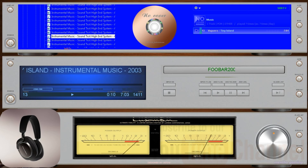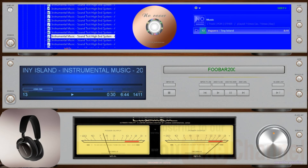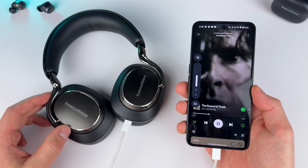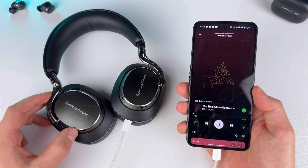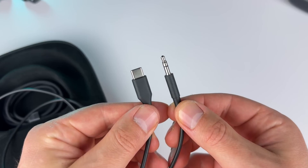This DSP is where the magic happens. It receives the full, untouched 24-bit signal from your PC, then performs the volume attenuation — the math — inside its own 24-bit environment. Think back to our photo analogy: you're not reducing the number of colors, you're just applying a transparent dimming filter over the full, high-resolution image. Even if you're listening to a mere 16-bit CD-quality file from Tidal, that 16-bit signal is placed inside the PX8S2's much larger 24-bit container. When you turn the volume down, the DSP has 8 extra bits of headroom to work with — it can scale the 16-bit data down perfectly without ever truncating the original 16 bits of information.